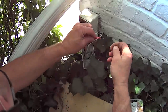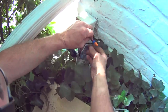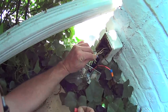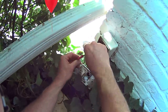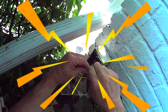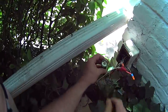So the red one is over here. We twist it clockwise, hold it next to the other wire, and screw the wire nut on till it's nice and snug. Then take the white — same thing, twist clockwise, hold it next to all the whites, put the bigger wire nut on because you can see this is actually three wires bundled. The last one I left capped is the black to black — put a new wire nut on and twist to the right, hold it next to it, and twist it on. Now because this thing is active, the lights are probably going to be off at this point.